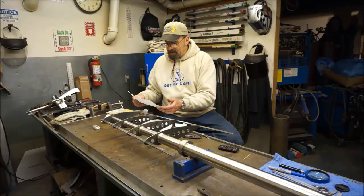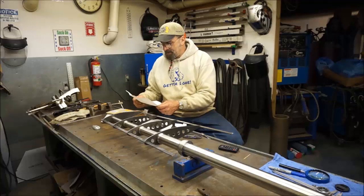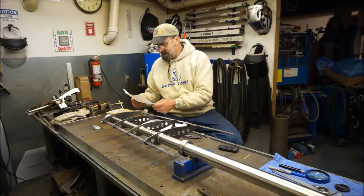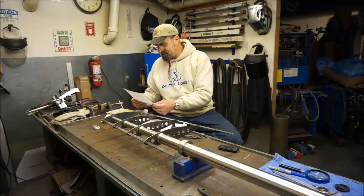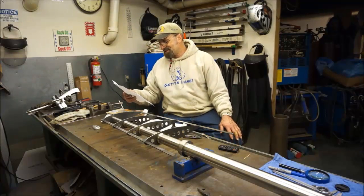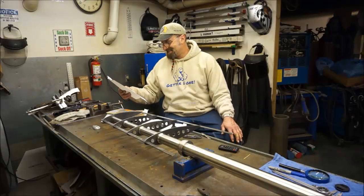Dear Keith, you mentioned in your video making the internal spline that your gear tooth caliper was missing a lock thumb screw. I thought that making one for you would be a worthwhile few minutes on my 1942 South Bend 9-inch. I hope your caliper is the same as mine, 20-2 diametrical or thread pitch, or at least that the thumb screw is the same as in number 356. It is the first time I've single-pointed that small and fine a thread, so it's something new for me. If by chance it isn't right, let me know the correct size, and I'll have a go at it. It bugs me for a fine tool to be missing a screw, but that's probably not... I'm probably missing a couple, huh? Best regards, Richard.